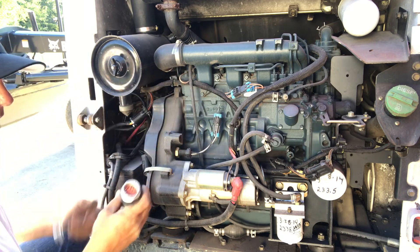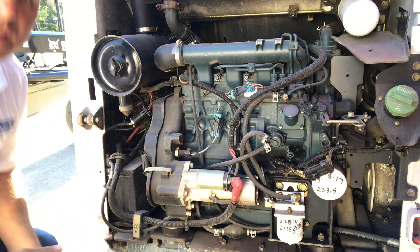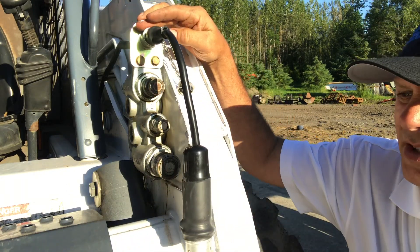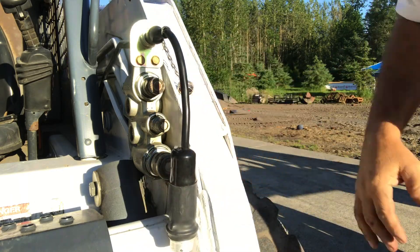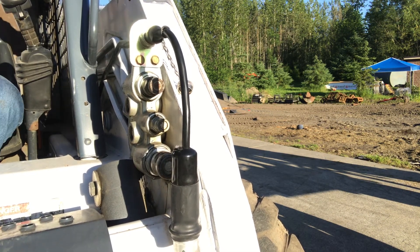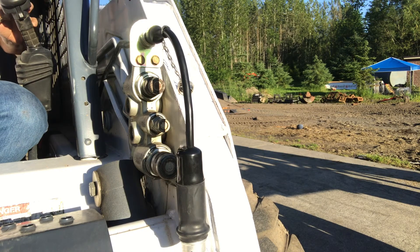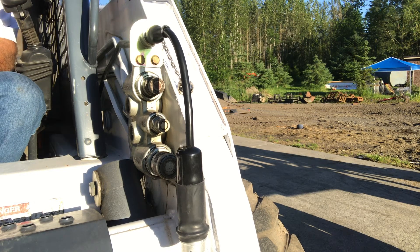Here's my controller — I can plug this in on the front and test it to make sure everything's good. I've got my Genius four-channel controller, the 4014, plugged in here. I fire up the machine — again I don't have to actually operate it, just turn the key on. You can see it flickering, and as I go through the buttons you can see each one of them change state, and that tells me I've got full function. Everything's working perfectly and it's all installed right.